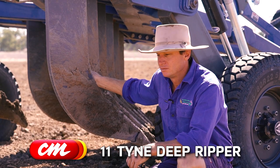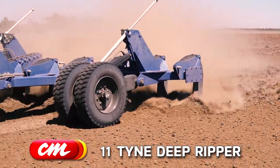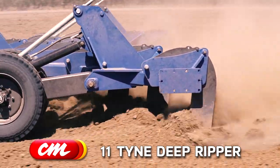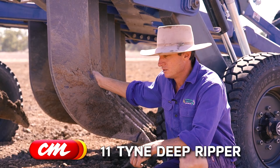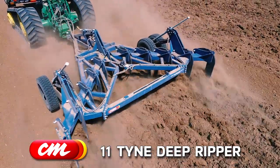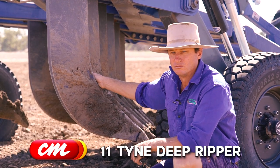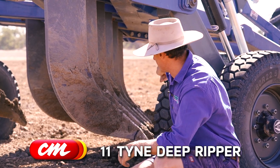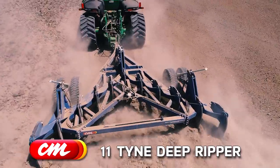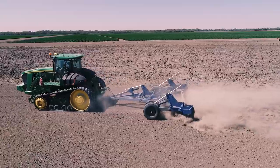Since operating this machine, we had an older machine that was using up to about 26 litres a hectare. It was a lot narrower machine with a smaller tractor, but since we've been using this machine with the bigger horsepower, we're roughly about 20 percent better on fuel saving. This is due to the V-type design — the first tine hits the ground and it's like a domino effect, which saves on horsepower and no doubt saves fuel as well.